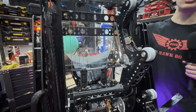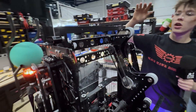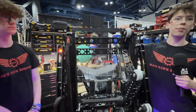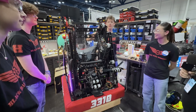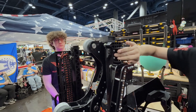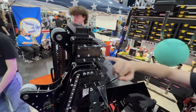We decided to go with a continuous design, which we do nearly every year that we do an elevator. It moves up by stage. We put on hard stops to hold it in place because a lot of problems we used to run into were the elevator not being tight enough and moving forward or backwards — even falling out. We changed these holders: originally they were 3D prints with a bar across, but now we clamp it in with aluminum bars and use rivets rather than screws for a tighter fit.